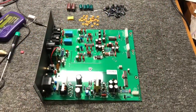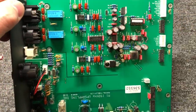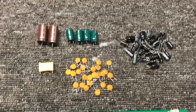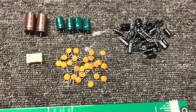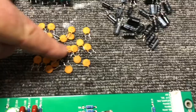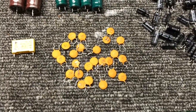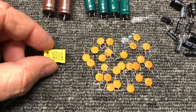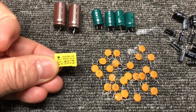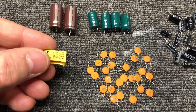I have just finished working on this M1 DAC. This is a series of mods that I've come up with for this unit to try. You can see just how many parts I've changed — this has taken hours. There are literally about 30 electrolytic caps and another 20 or 30 ceramics which I've replaced with films. And there was an X2-rated cap which was dead — that's really interesting. It measured 100 picofarads; it's meant to be 100 nanofarads. So yeah, there's a problem there.